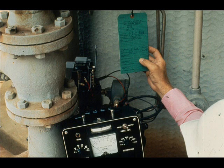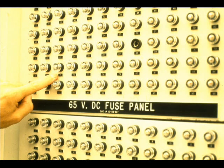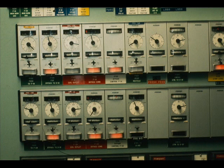Remember that neither the 8121 current calibrator nor the 10 to 50 milliamp E13 are intrinsically safe. On completing calibration, reconnect the transmitter red and gray wires and re-energize the loop. Other items in the loop can be checked at this time. The final calibration is never better than the entire loop calibration.